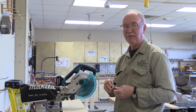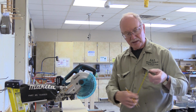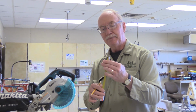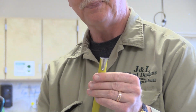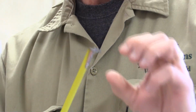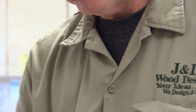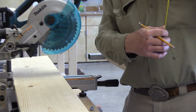You should never let your tape measure slap because that accuracy goes away, and all you've got are these two little tiny rivets holding that tab on. See those little rivets? There's just these two little rivets holding that whole thing on there. And they're actually made to slip back and forth the amount of thickness. So if you push against something, it'll measure accurately, or if you pull, it's going to measure accurately. That's the thickness of this tab right here.